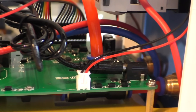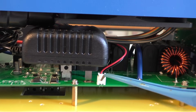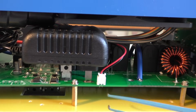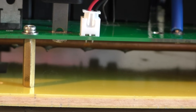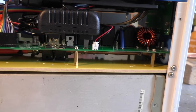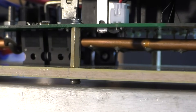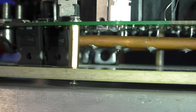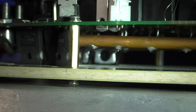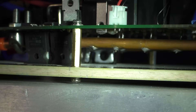On the other side there is a barrel plug that goes into a receptacle on the board. I guess you can buy the board separately and supply your own power supply. This is the 230-volt supply that goes to this power supply, and I'm not sure but I think the insulation distance here is a little bit too small for 230 volts. Also the cables are very thin. The power transistors are underneath the board and they are soldered directly to these copper tubes here — that's good for cooling because there is water flowing through these tubes.